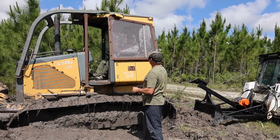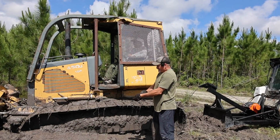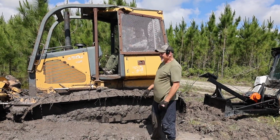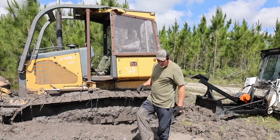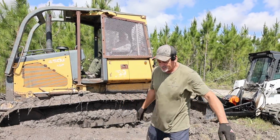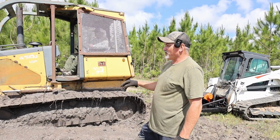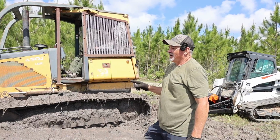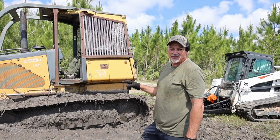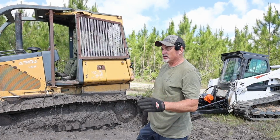But I think once you got that initial suction broke loose, I mean, it wasn't. Another 2 days, if it let it dry up, it would have been all right anyway. So this wasn't really stuck, but stuck enough. Yeah, give the winch a good try. Again, we talked about earlier in the video about snatch blocks and straight line pulls. That's about all that wanted for a straight line pull without no help. So what we'll do next time is we'll definitely snatch block it regardless if we think we could pull it or whatever. Get that extra help.